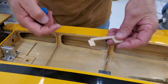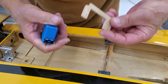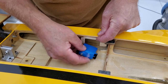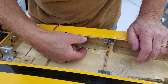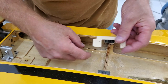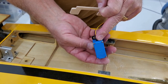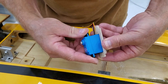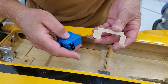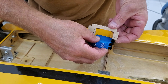This is a throwaway I just happened upon the other day, but I thought it was perfect to show you what we're doing. The reason this isn't the one we're going to use is because it's not enough — I don't just want to put this up here and have my servo kind of dangling. I want a full top-to-bottom piece on this end. The mounting screws are going to go right into this rib right here. I need a wider slot on the bottom than on the top where the servo is actually going to sit, because the wire in this raised area gets in the way.